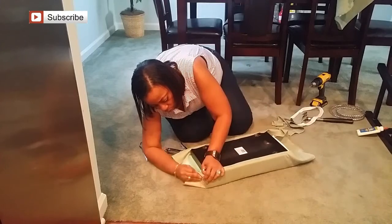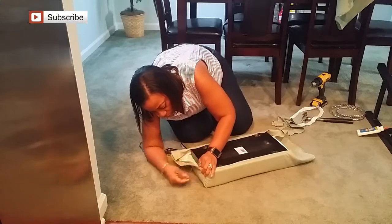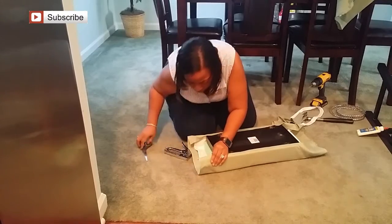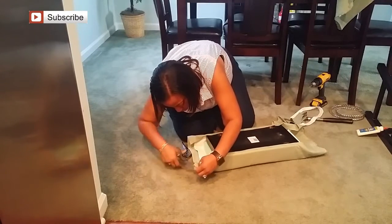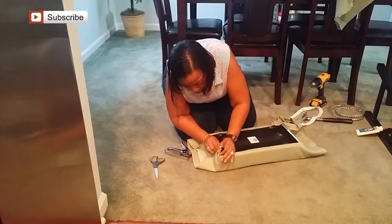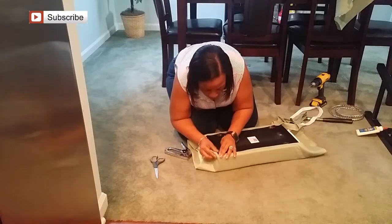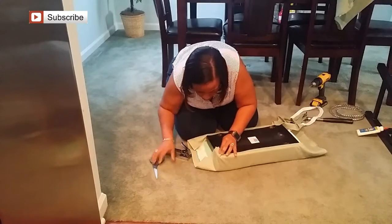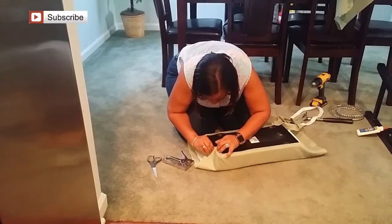The sides are a little bit tricky because depending on how you want your corners to be will determine how you'll fold them. I want my corners to be kind of like wrapping a present, so I'm going to cut a little bit of the excess out here and then fold the corners up and put a staple on them. That'll give a nice little round corner. Make sure you check the sides that it's not leaving too much of a crease, and put in a temporary staple to hold it until we get everything the way we want.